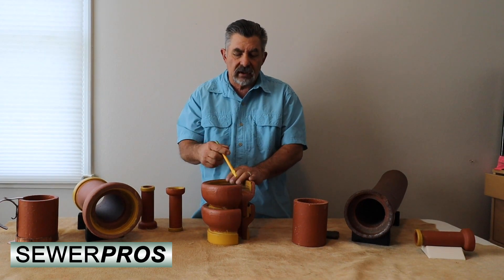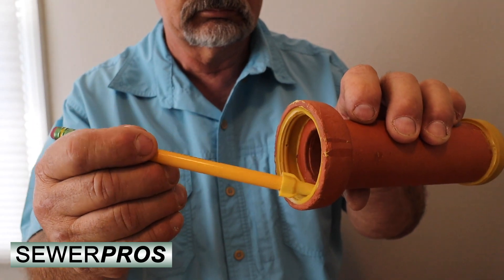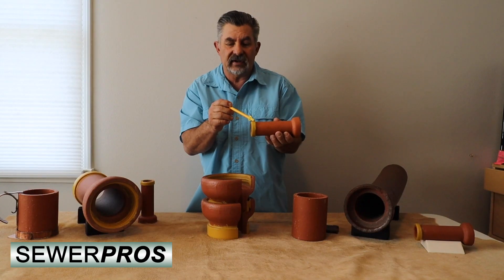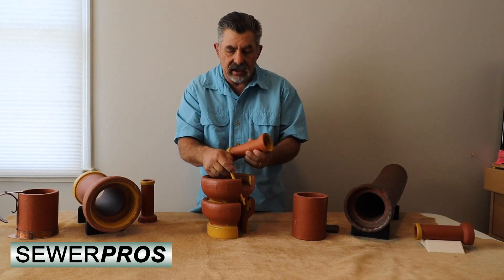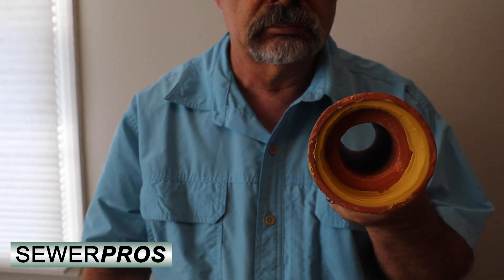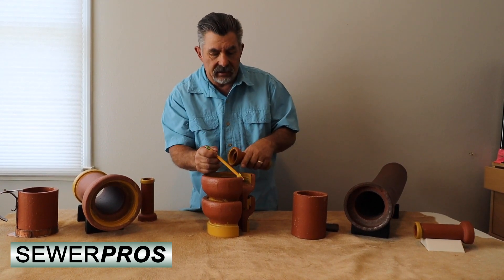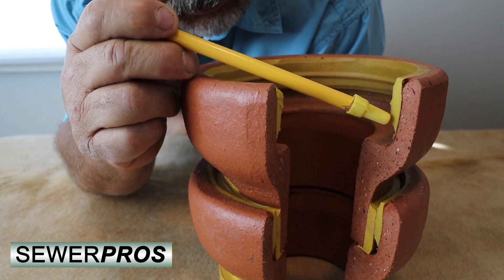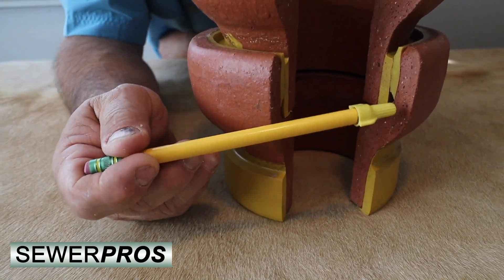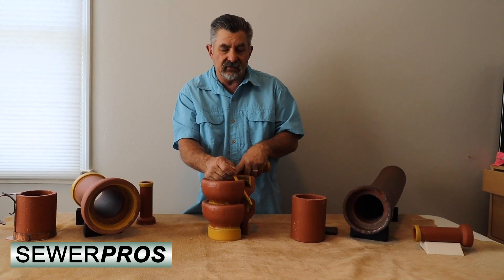As you can see right here, there's a difference in the joint. The joint is actually poured in place — this is urethane, similar to the same type of urethane on skateboard wheels. You have a straight pour where the common outside diameter is maintained, visible in this sample. On the spigot side, the ID is poured to match the OD but is slightly smaller, so when slid together there's a compression fitting. Most importantly, there's a triangular bead that bites into the OD of the spigot, creating a very tight waterproof, root-proof seal with great water integrity.